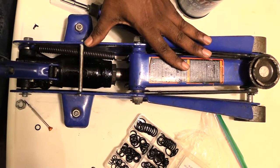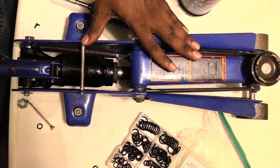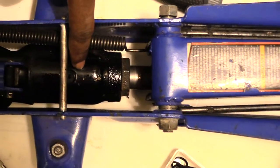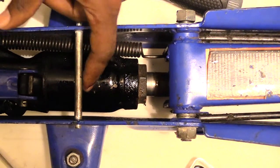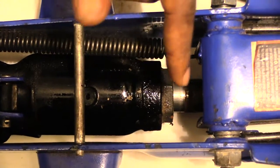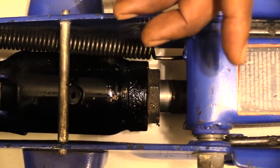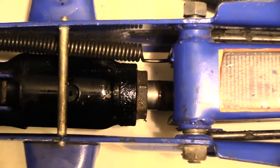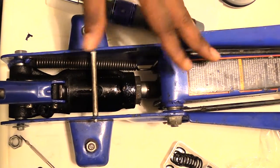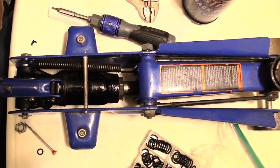This is how you would repair a hydraulic jack that won't lift anymore, as well as how to add new hydraulic oil to your hydraulic jack. The oil goes right in this little opening — sometimes you'll have a Phillips head screw you take out, or a plug like this one you pull out. Either way, open the valve all the way when putting your fluid in, then close it up and bleed it by opening the valve all the way and pumping about 20 times. Do that twice to get all the air out, and that should take care of your problem. Please check out other helpful videos, like, subscribe, and share.